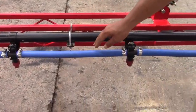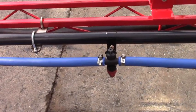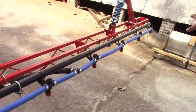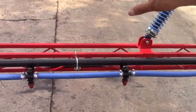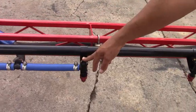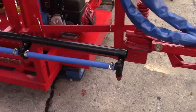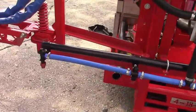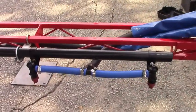Normally we don't use this blue hose, but that's what he wanted — in the custom equipment industry, that's the kind of thing you get. He wanted each section to have nine nozzles, but because of road widths and the legal width that the sprayer can be, we ended up with five nozzles in the center and then two nozzles on each outside boom, because he wanted each section to have the same number of nozzles.